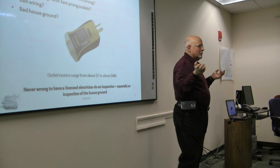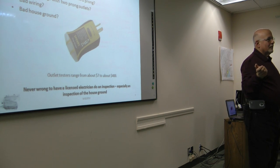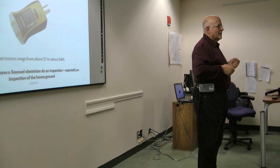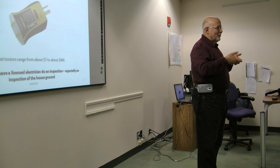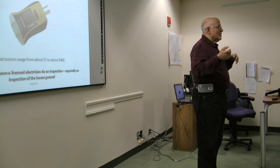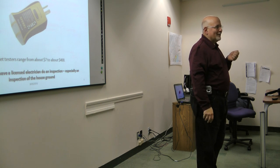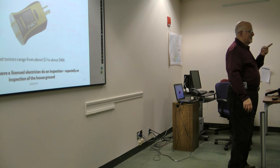Okay, especially again in an older house, some of those outlets may not be wired correctly. They were probably retrofitted. Somebody may have just retrofitted a three-prong outlet without actually connecting the ground. You know, I used to have a two-prong outlet. My house had two-prong outlets. I got all these devices with three prongs, so I just substituted three-prong outlets for two-prong outlets, but I never actually ran the wires necessary to make that work. So check it. You may or may not have a ground.